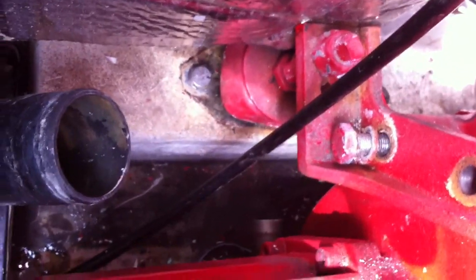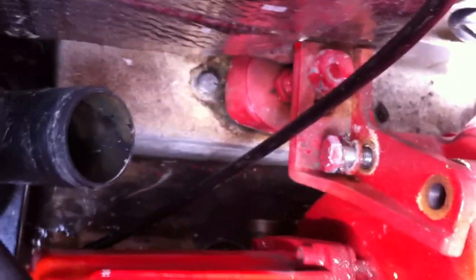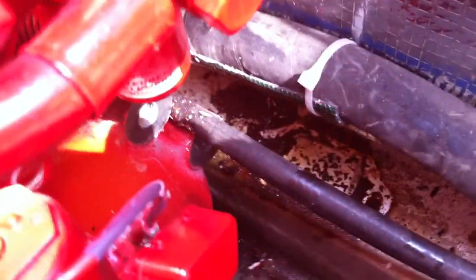This is a lot easier to do if you've got the exhaust out of the way and the hoses. So if you're going to change the heat exchanger or the elbow or the hoses, do the motor mounts at the same time if you've got them. I got the other mount out. On the starboard side it came out pretty easy, but this one I had to use a little bit of PB Blaster to get the holes to open up. I'm going to clean that all up down there and put the new mounts in - probably put the hoses on and the new mounts in in a couple days and put it all back together.